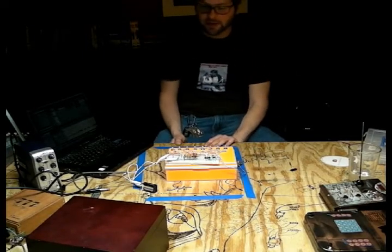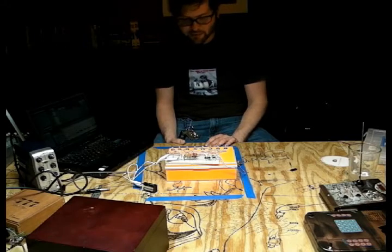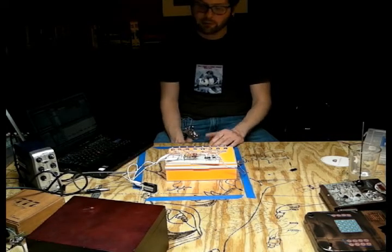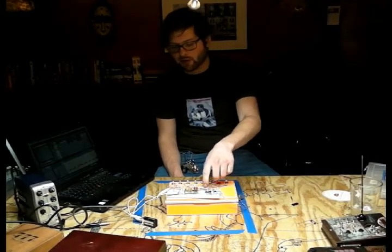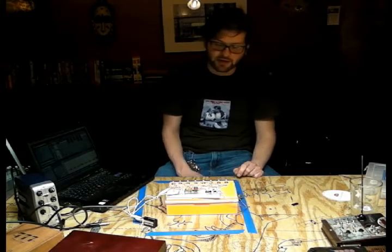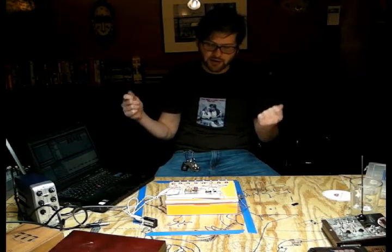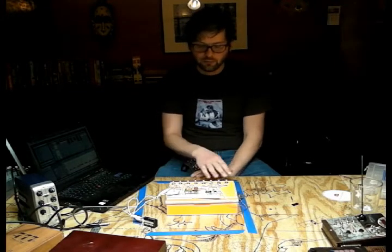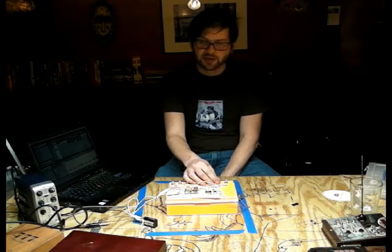Not the easiest thing for me to explain, but don't let it get to you. It's very, very simple stuff, and once you figure it out, it kind of makes sense. If you figure out how a pitch resistor works on a toy, and how a 4017 works on a toy, then you have somebody explain how these NPN transistors, once voltage is applied to them, connect the two outer legs. You can think about it as a switch, and that switch is in essence just changing which pitch resistor is doing the resisting. Okay.